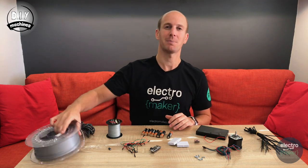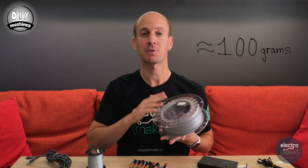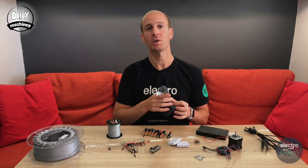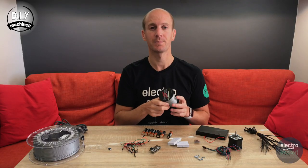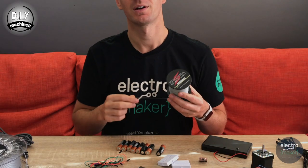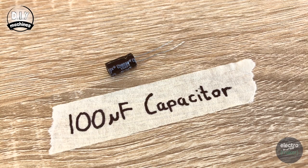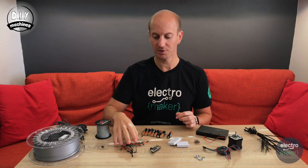The first thing you'll need is some PLA plastic. You only need about 100 grams, and we'll use this to print the main body and the spindle of our Alexa system. A long USB A to Micro B cable. Some steel fishing wire — normal fishing wire is too elastic, it stretches too much, so steel is much more suitable. A 100 microfarads capacitor. Some electrical wire — I'm using some jumpers.